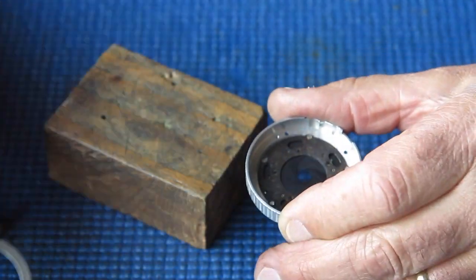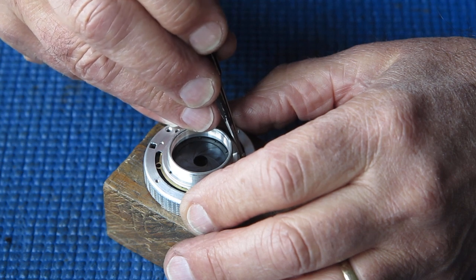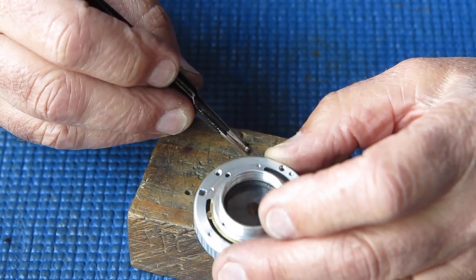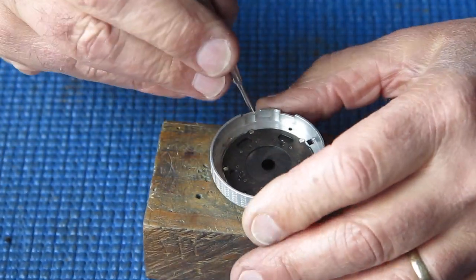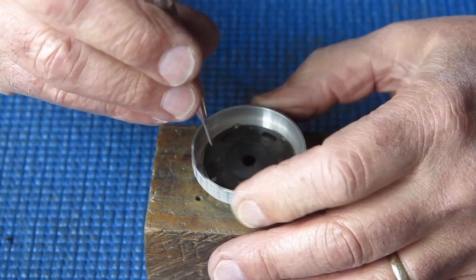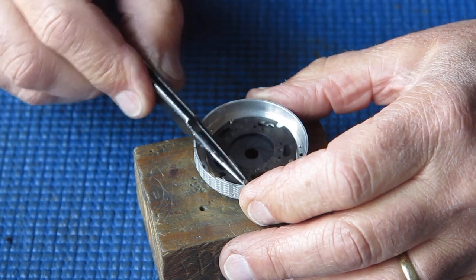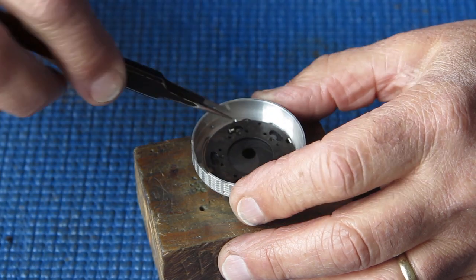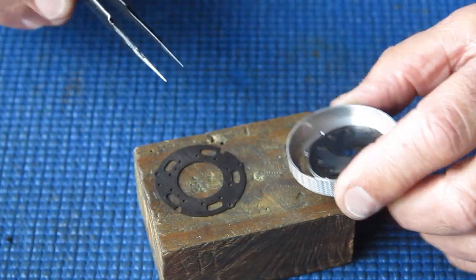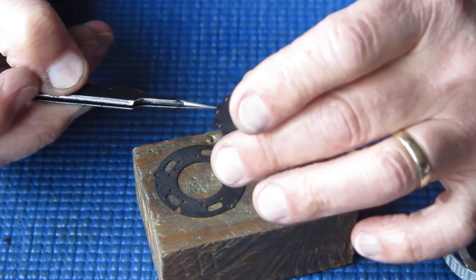There's nothing remarkable about that ring — it's relatively clean. See if I can get those two shoulder screws out. One's fallen out; the other has just wriggled out now. We've got the retainer plate here — three screws, one of which is a countersunk head screw with a matching countersink in the plate, so it's not hard to figure out which one went there. These three screws come off and I lift off the retainer plate, then tip the whole lot out in one go. Now these blades — it's quite normal for them to come out as a rosette, but these are particularly sticky.